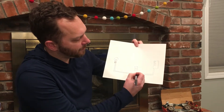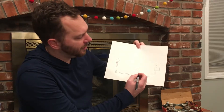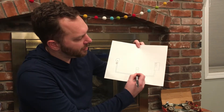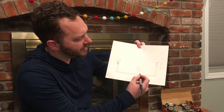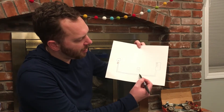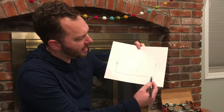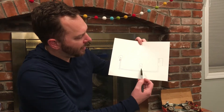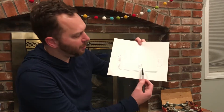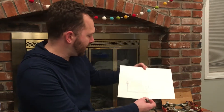What happens is, when we install a smart switch, it adds a new type of resistance to this light switch. The power is actually going to go through the hot wire and up, then to the neutral and back to the breaker box, making its own circuit without the light being engaged. And then when the light is engaged, the power goes through.